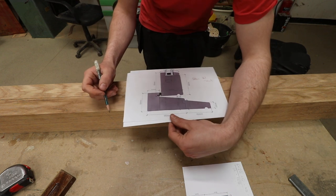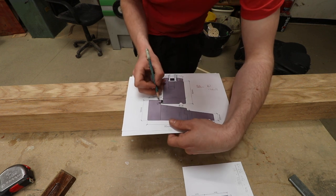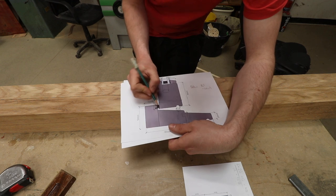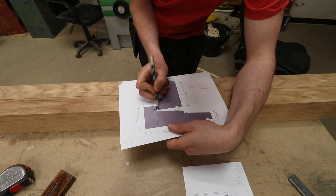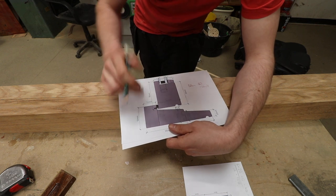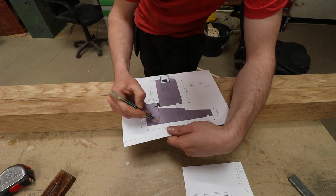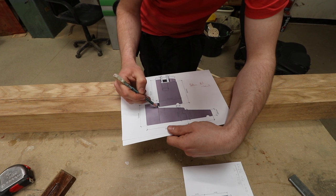Now, in terms of getting your head around what a setback is and where the setback comes in, obviously the mortise is this position here. So where that rebate is, you're chiselling away or cutting away that material in that section. So if that was the vertical piece of timber, you're physically cutting away at where that mortise is. So the mortise is no longer the full width of the timber, it's less the amount that you're cutting away.